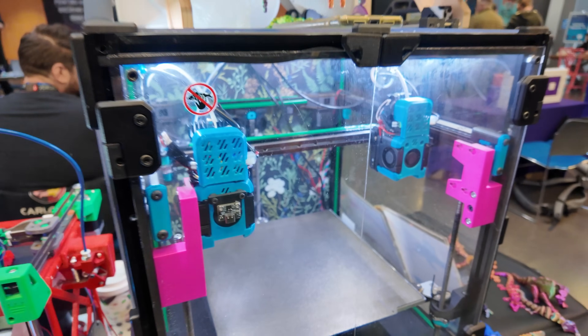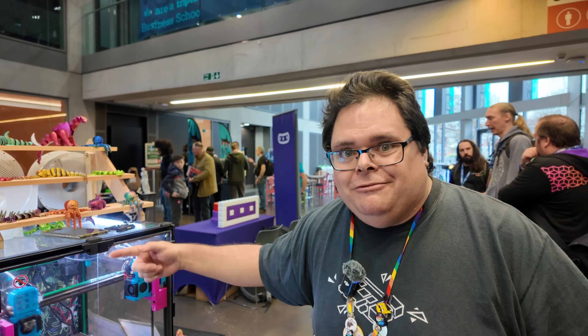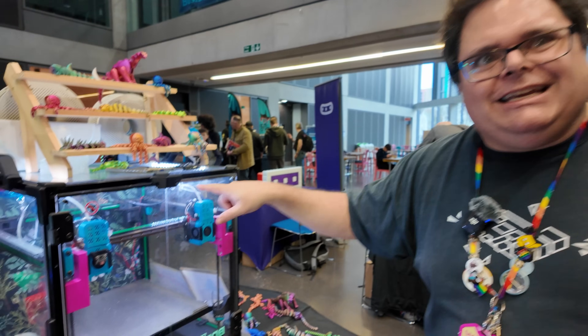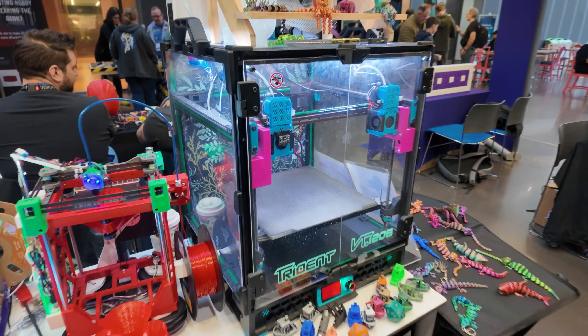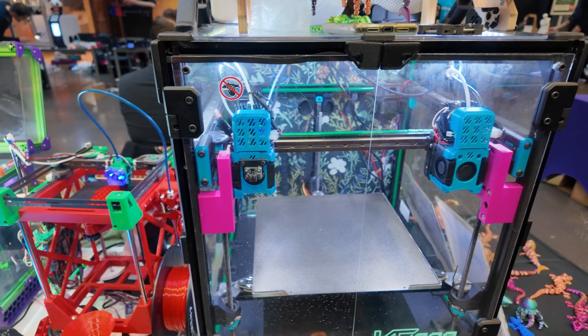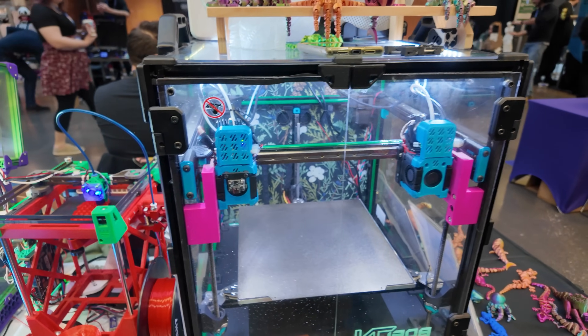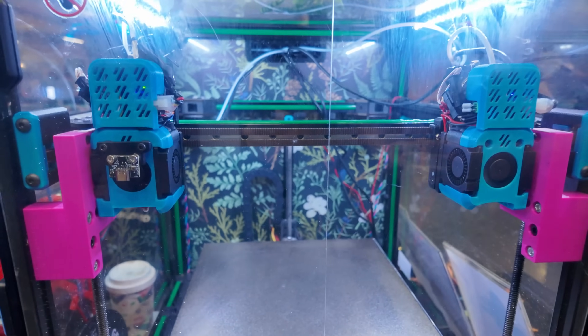Docks for the 2.4 are being designed as moving docks that travel up and down with the gantry. You could add more docks along the front — put a bar along the bottom with more docks sticking up — and easily get four tool heads. The magnets are really the biggest cost, and if you buy those by the hundreds the overall system cost is minimal.